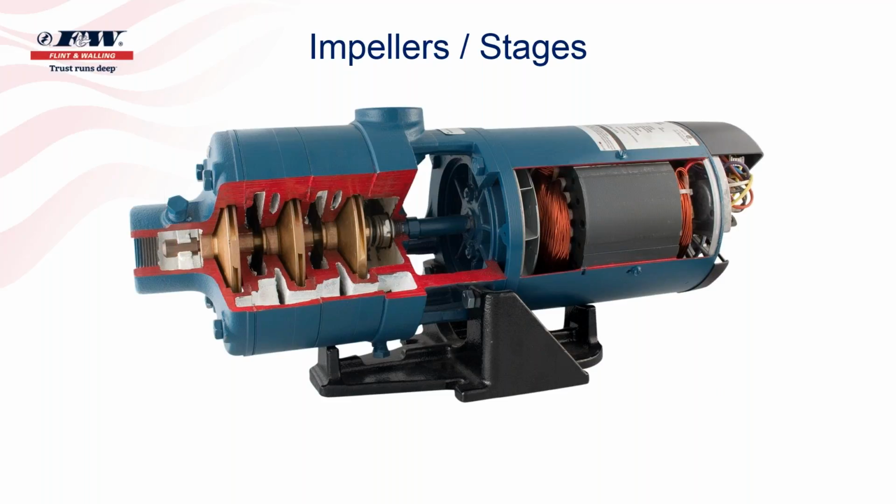And he shared with me that he had several centrifugal pumps that were pulling water out of a lake. He had several houses that he was irrigating. And he told me, "Every year I have to go out and change those plastic impellers, and in some cases I have to do it twice." And I said, "Well, what's going on?" He said, "I take the pump apart and the impellers are just in shreds." And I said, "Well, what's shredding these pumps?" And he held up his little finger and pointed to the fingernail. He said, "All I can tell you is there are little tiny shells getting inside that pump housing. And they're just creating havoc on those nylon or plastic impellers that I've got. I reckon those brass impellers will hold up better, won't they, sir?"